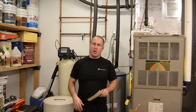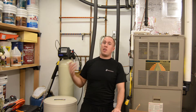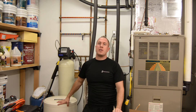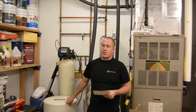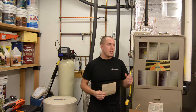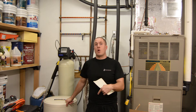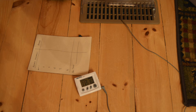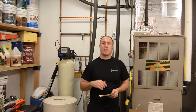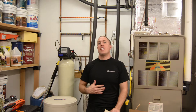I went above and beyond with the insulation — using insulation ducting plus foam plastic covers on the pipes. I got some interesting results. I tried to keep the test as constant as possible. The instrument I used was a TrueTemp cooking thermometer — I'll put a link in the description. I dangled it in the vent in the exact same place for all vents, making sure it didn't contact the metal and that the vent was completely open for full airflow.